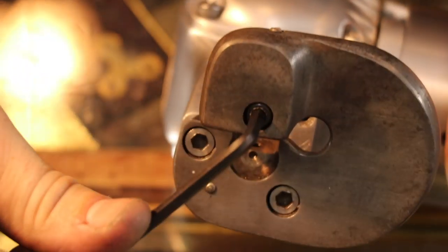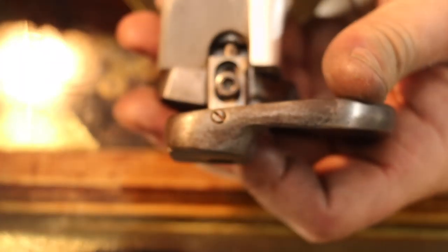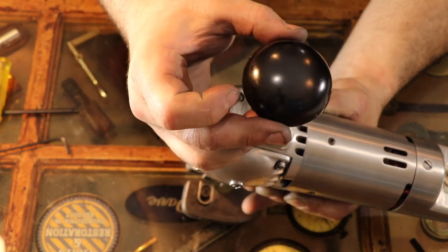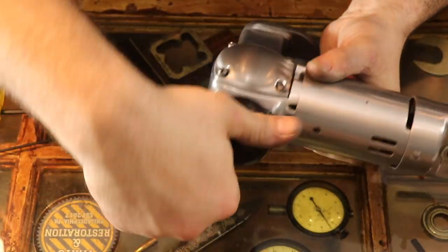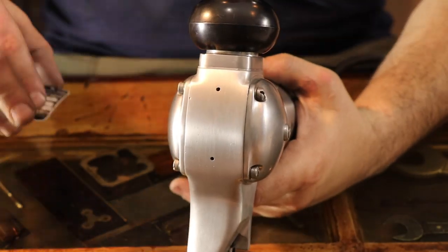We're putting the cutting shearing teeth back in place. You've got to set the clearance on those with a feeler gauge — I think it's like a couple thou clearance. There's the hand holder and we're done, except for the nameplate. I was able to pop those rivets out from the back because the holes were through-drilled — just used a punch. And of course, a little branding.